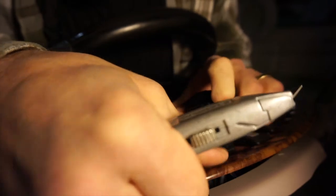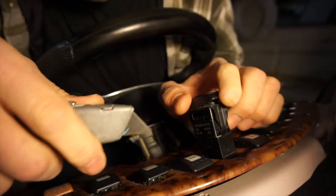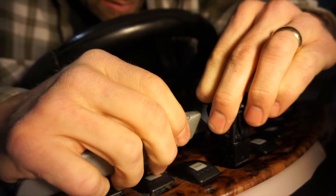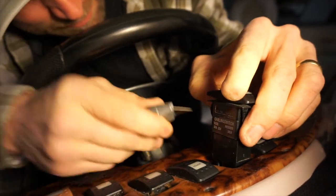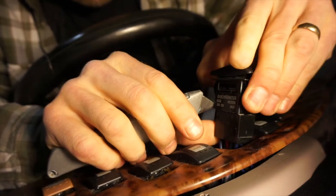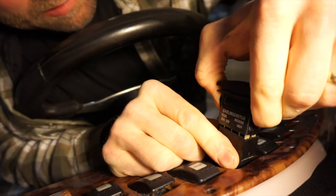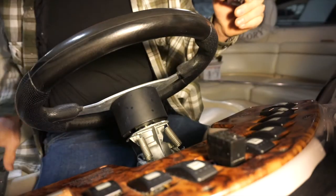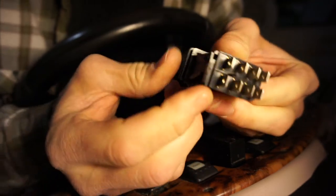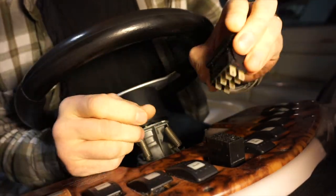We're gonna put this switch in — it's pretty easy. You get them up above your dash; that's the easiest way. Pulling them down seems harder because of all the wires down there. I always pull them up. There's one little clip on the back side — all you've got to do is pull this little tab back while you pull up on the switch and wiggle it off. It's really hard to pull off, but it'll go. I'm always trying to be really gentle — there we go. That little flap had a barbed hook sticking up above it, so I had to pull it back.